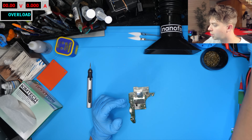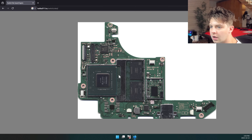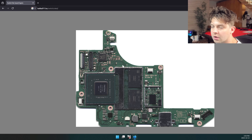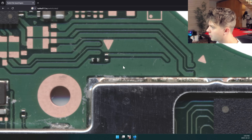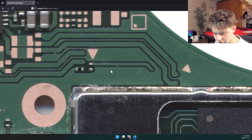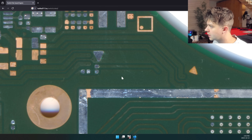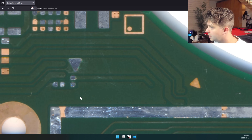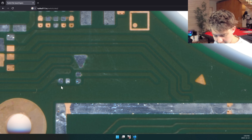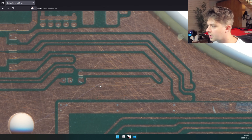Let me show you a really cool tool we're going to be using for this repair. These are some board layer scans from the OLED console — I'll have a link in the description. There are also board scans for the V1 Switch and the Lite. These are interactive: you can click and drag, and press W to go further into the board. You can see this is with all the components off — still the top layer of the PCB — and we can see what happens if we go one layer further to take the substrate off.